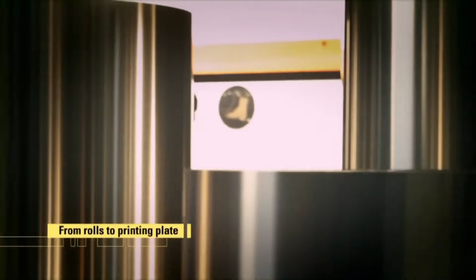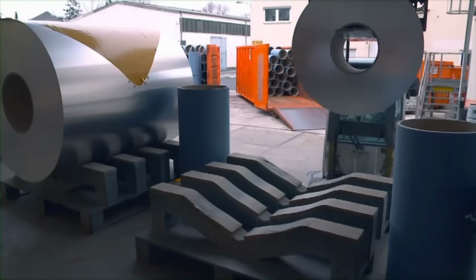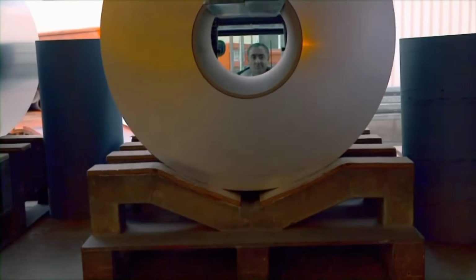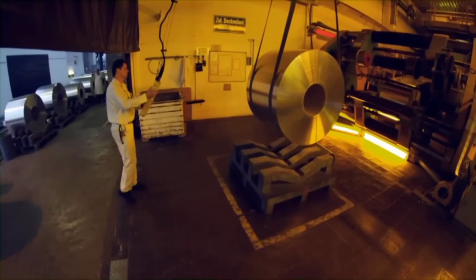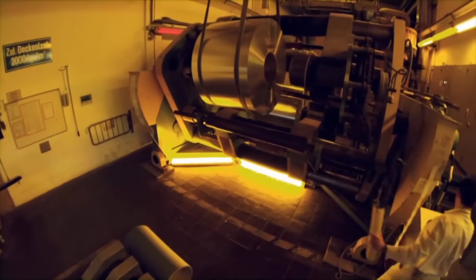In the coating process, aluminum coils are unwound and subjected to surface cleaning, electrochemical treatment for roughening, and a computerized application of a light-sensitive coating. Quality checks, including CCD or laser inspections, ensure perfection. The coated aluminum is trimmed, cut, covered with protective sheets, and inspected before packaging as printing plates ready for shipment.